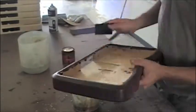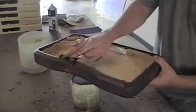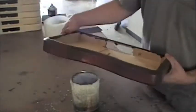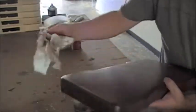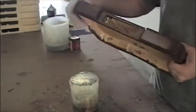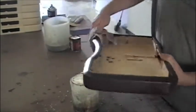I just did the bevel keeping it flat, and now I'm going to come back and just skim the top — very quickly skim. I'm not removing much of the clear coat and definitely not removing any of the stain. Once we've sanded it, feel it to make sure there are no rough edges, then go back with a cloth and dry it off really well, getting off any residue left over from sanding.